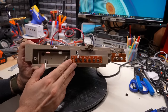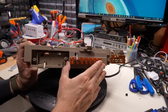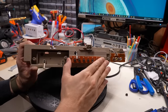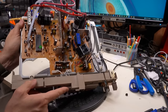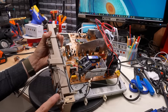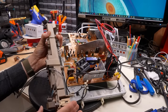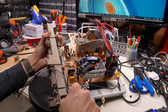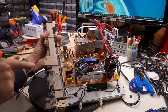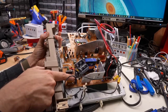With the main board in there, I went ahead and mounted the front controls using hot glue for now — maybe I'll add screws later. The wire from the front panel is routed to the correct connector on the board, and I hooked up the power switch and mains cord. The live or hot leg goes into the switch so we're switching on the hot side; it's a polarized plug. That comes out and goes into the hot connector on the motherboard — I've soldered it, put on heat shrink, and it goes into a fuse. The neutral wire is extended and runs to the board in the appropriate spot.